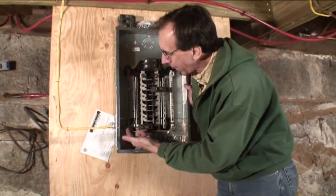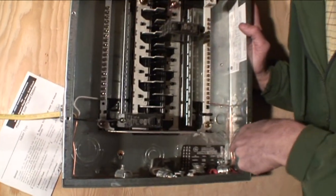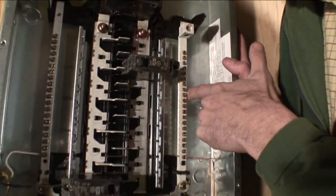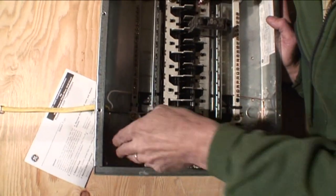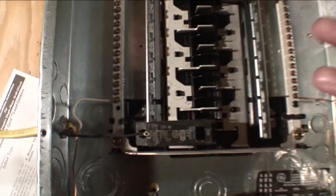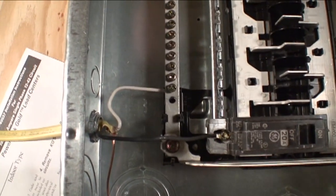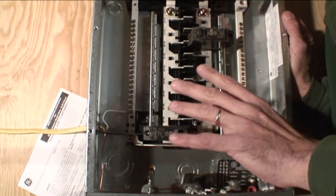So we come through — we've got the hot wire, we've got the neutral going to one bus bar, and on the other side we have another bus bar for the ground. I've tried to make all the wiring nice and neat and rectilinear, with nice right-angle turns. We want it to be easy to trace wires. If somebody comes into this box after me, we want to keep it nice and neat and clean.